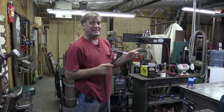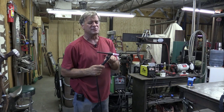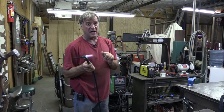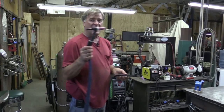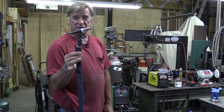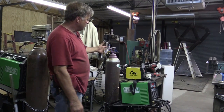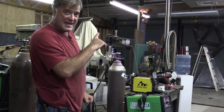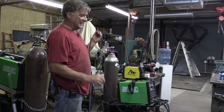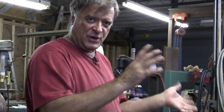The AHP 160ST does not come with a TIG torch — you have to get that separately. I ordered this one through gamblesgarage.com. The big difference between the two machines is that the Everlast routes gas through the machine and through the torch, while with the AHP you use a little knob on the torch to control your gas flow. With the AHP, there's a really long hose that hooks directly into the flow meter.